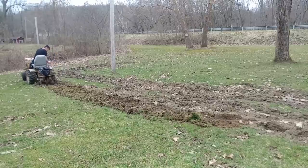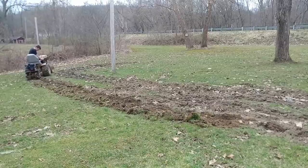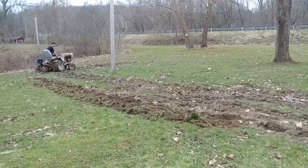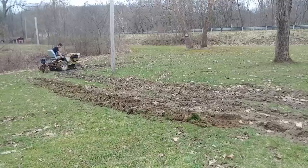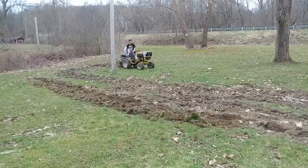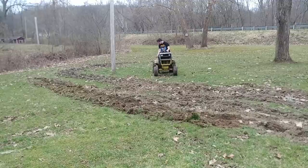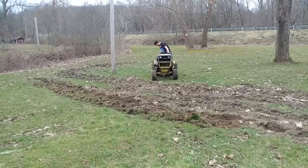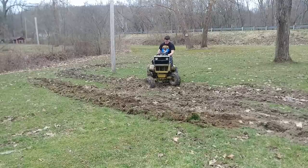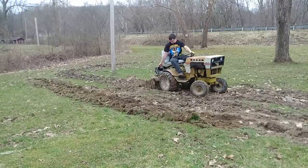What I have to do is put a larger pulley on the motor — it only has a two-inch pulley. I would really like to get the tines spinning a lot faster. I think if I doubled the pulley size, that would be awesome. I also have to put more tension on the belt, because I'm putting more pressure against the tines going forward while the tines are rotating in reverse. But I found a better clamp — actually a free clamp from Harbor Freight — and surprise, it actually works quite well once things get worn in.